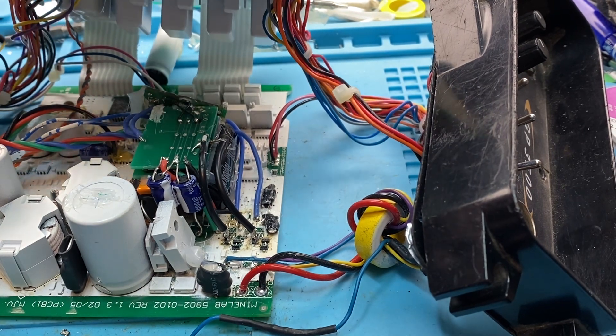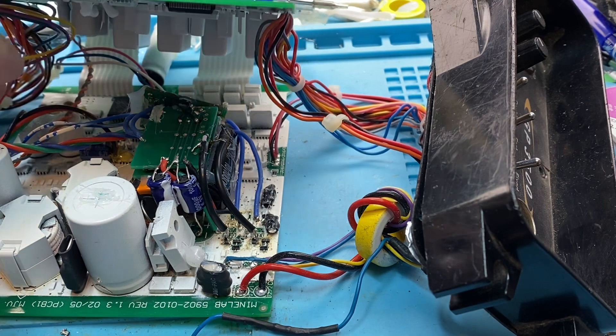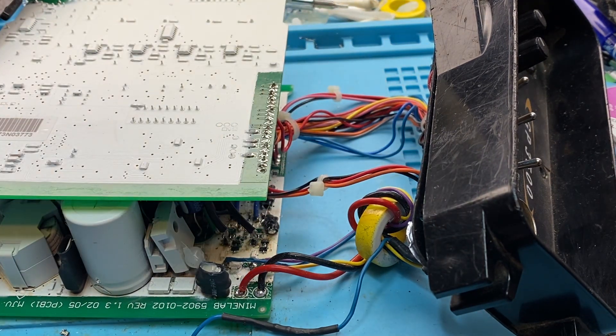There's also extra filtering on the variable frequency. When you do variable frequency on these you've got to keep the supply rail to your frequency control very, very stable — no ripple on it. Any ripple is modulating the timebase for the receiver. If that thing is jittering around and moving in frequency it'll affect the input signal and transfer modulation through everything. You need a very good lockdown — a super smooth, stable supply on that part of the circuitry.